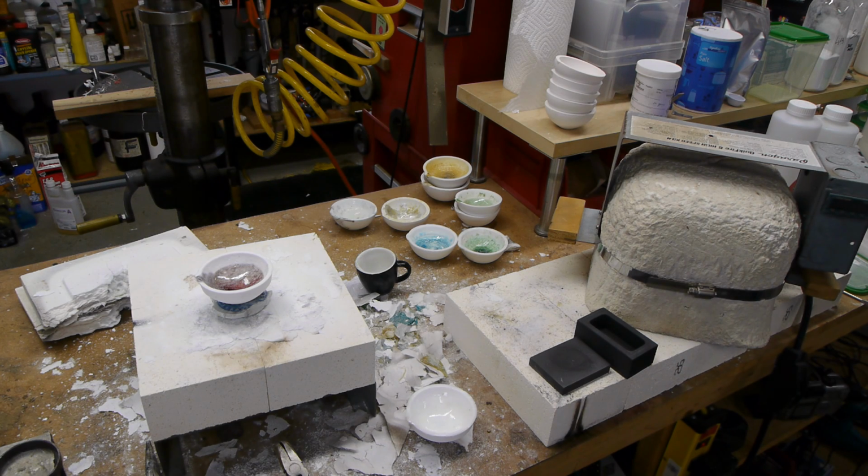The reason that this kiln is limited to maybe 1150 C, or even 1250 if you really, really push it, is because the heating elements themselves are made of nichrome. And eventually it melts. So it's a pretty hard limit on how hot you can get it, because your heating elements eventually get so hot they melt. So that really does put a cap on things. And unfortunately most silica glass batches have a rated melting or forming temperature of 1400 or 1500 degrees C, which is much too hot. You'd never get your nichrome furnace that hot.